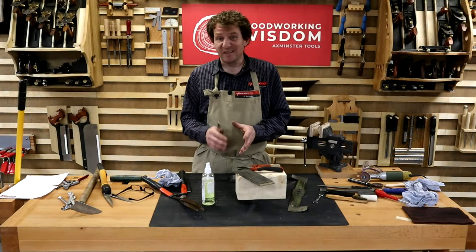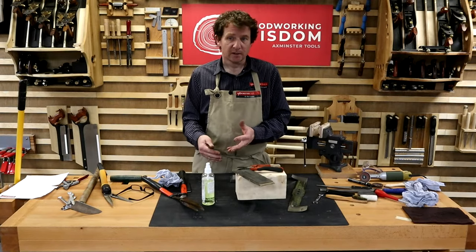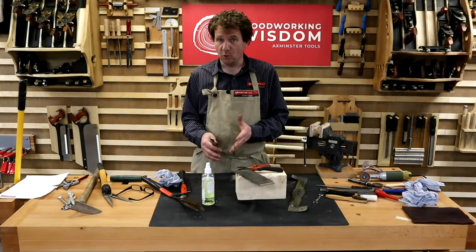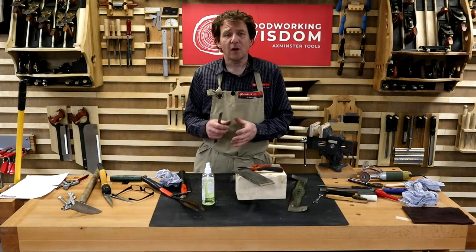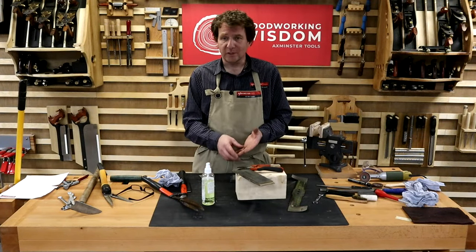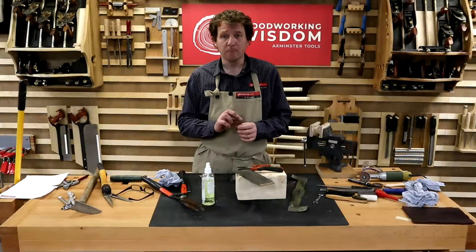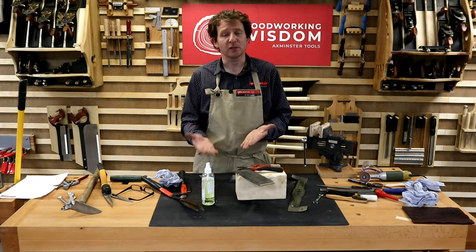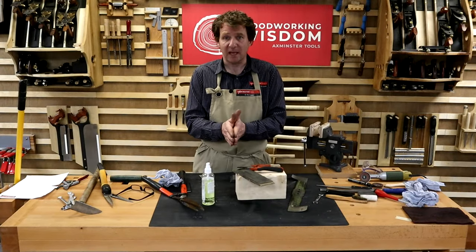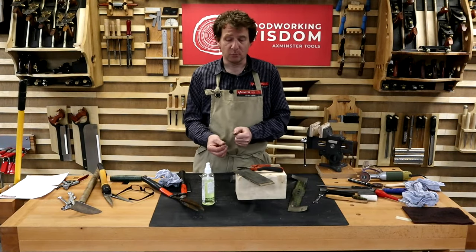Motorized will speed things up. Yes, it will be quicker, but it's not as controllable. Right? It can be quite aggressive. You don't need to. And imagine, what we're doing here, I'm taking off a minimal amount. If you take too much off, you're going to grind the shape back. You're actually going to lose how those two blades come together accurately. That's really important to get over to you.